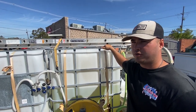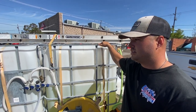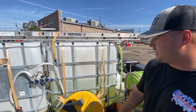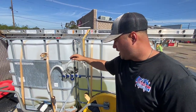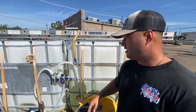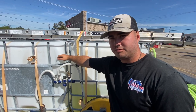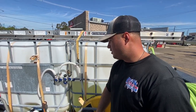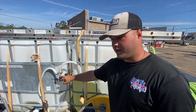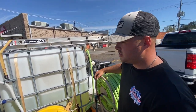A 20-foot ladder mounted on top was about $140 at Walmart. We also have a 30-foot ladder we already owned that we keep at the house for bigger jobs. We went ahead and plumbed everything on the trailer and put in a four-way valve system because we're batch mixing — we run our roof wash batch off the front tank and our house wash batch off the back tank, with a valve system to pull from each tank and swap it out.